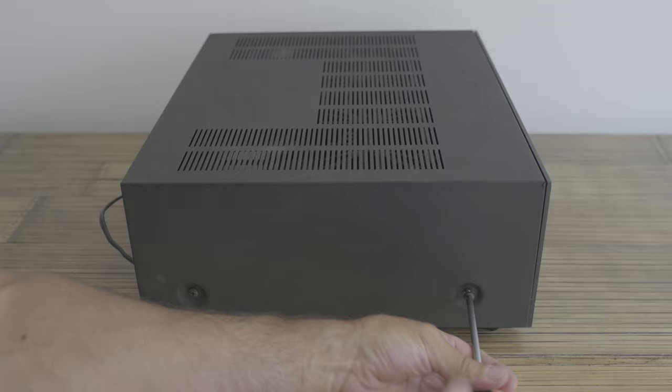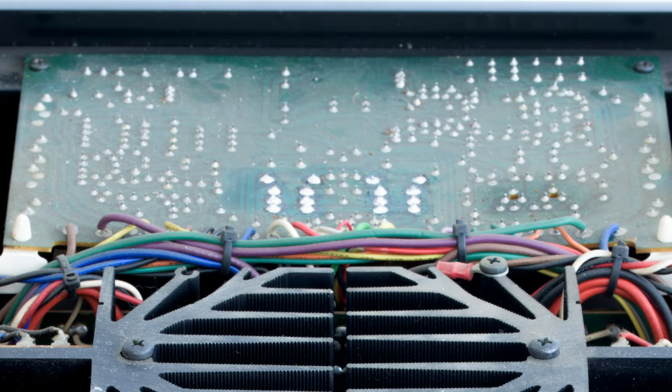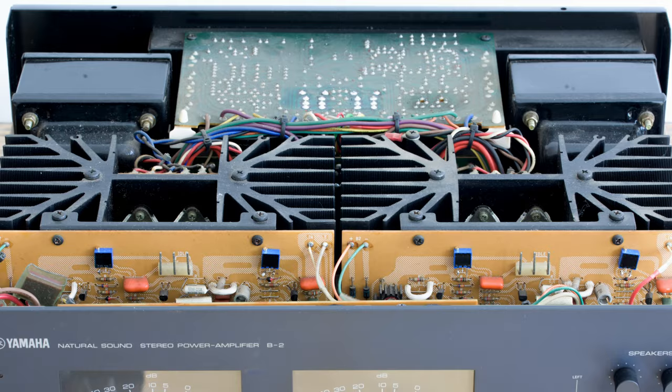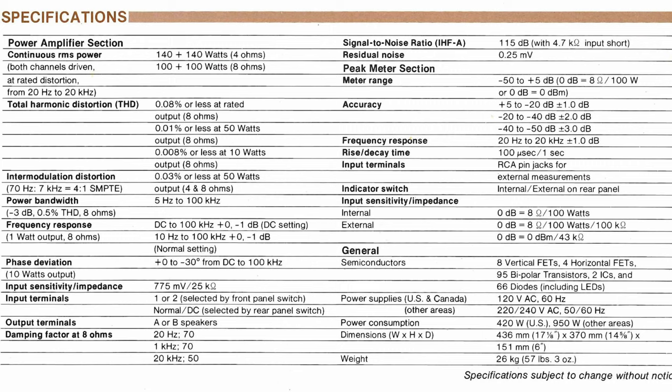Getting inside is easy. You can see it's practically split in two parts, except for this PCB which covers four 18,000-microfarad capacitors. Each channel has its own transformer, and on this PCB — one transformer, one channel. Power output is 100 watts into 8 ohms. She runs most home loudspeakers with ease. Distortion is pretty low at 0.08%, signal-to-noise ratio is 115 decibels, and she weighs 26 kilos — about 57 pounds.